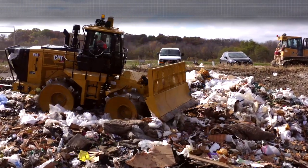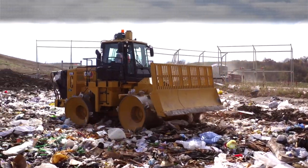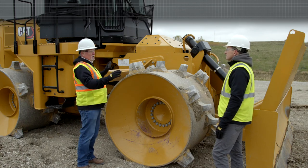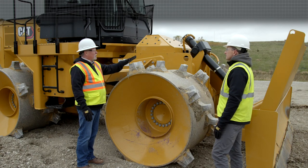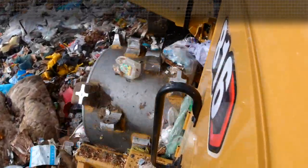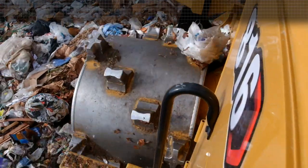The machine will go at its fastest speed throughout the day if it's on the lightest tip possible. The plus tip is the big, heavy tip — this will slow the machine down a little bit if it was all plus, but it's got great stability. This is like the rudder on a ship — it's easy to steer the machine and to hold it in a straight line on a slope. It does have some traction capability. It's a big, heavy tip that lasts longer than the lightweight, but because of that it slows you down a little bit.